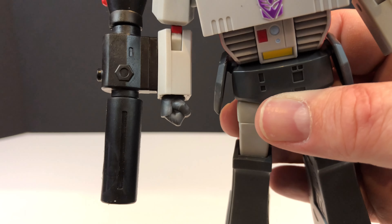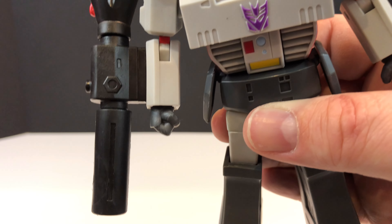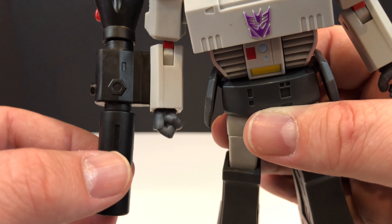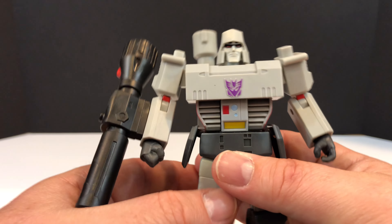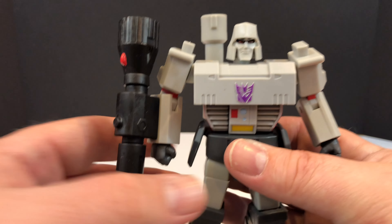Now there are some molding imperfections just from the plastic flow during the injection molding process. It takes away a little bit visually, but with the amount of plastic you're injecting into a mold for this guy, it's a considerable amount - so you kind of have to pick the lesser of two evils. My Fusion Cannon is slightly crooked - it has a little bit of a bow to it. I think it just didn't cool in the mold long enough, causing a little bit of shrinkage and curvature - but it's not bad, not too noticeable at an angle.